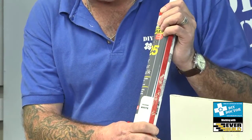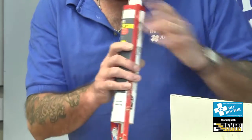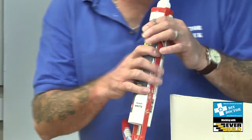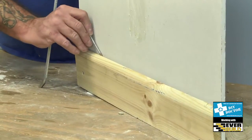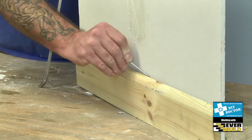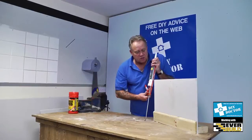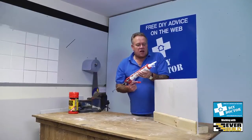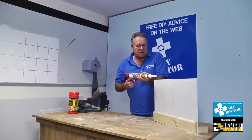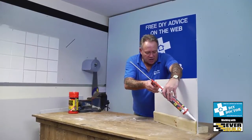It can be over-painted in an hour, which is most unusual for decorator's caulks. It's for filling gaps, and if the camera can pan down to this bit of skirting on this pretend wall, you can see there's quite a large gap behind the skirting. That's quite often the case in a lot of houses, especially with skirting boards and architraves. The EverFlex decorator's caulk is very simply applied and pushed down into the gap.